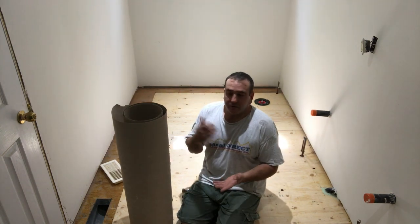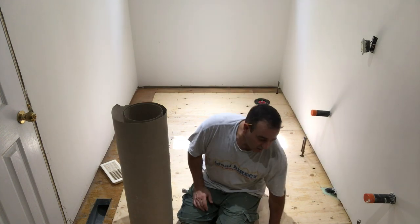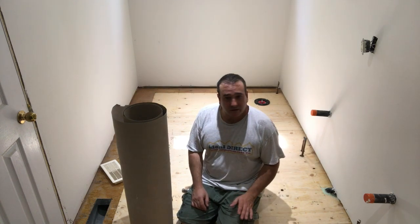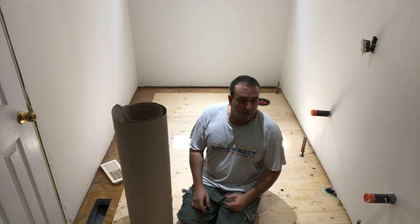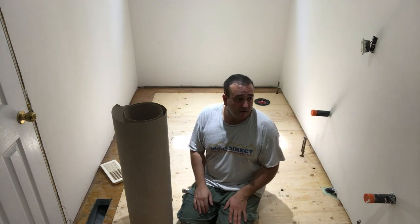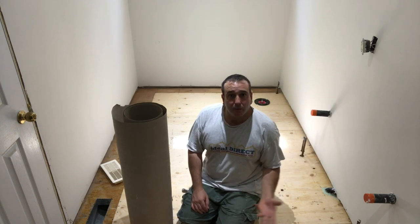So then throughout the whole stage of the remodel, even the drywall installation, you're going to drop a sheet, you're going to put it on the floor, it's going to leave drywall dust on the floor and stuff like that. So I didn't have an issue cleaning up so much because I put the builder paper down. Even when it came to the taping, the builder paper was down on top of the plywood, so it pretty much stayed really clean. When I was done the taping, that was it. I just swept up the dust from the builder's paper and then we primed the whole bathroom.